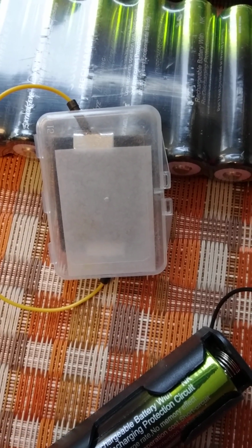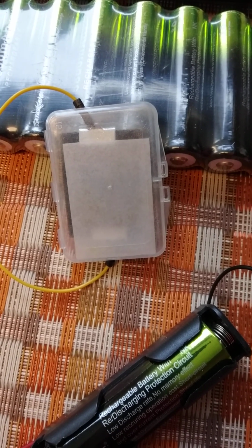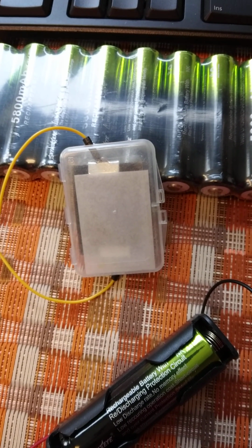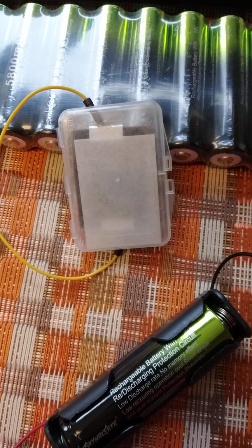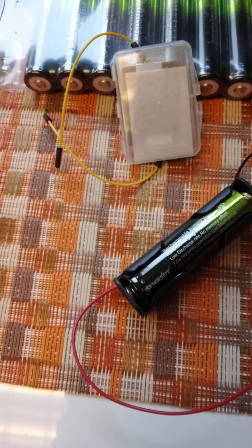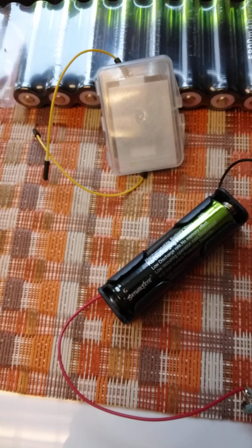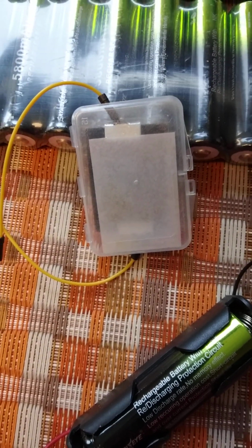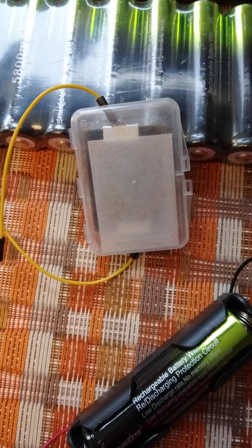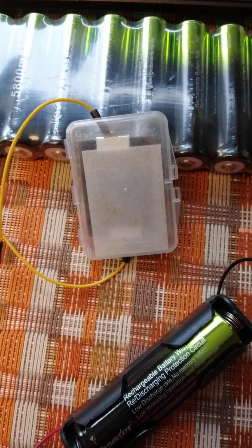It works very well, a section where after we applied the electrolyte solution, we put the paper in and pressed it to get it into the graphite. That paper was 0.1118 grams, so not much mass added there. And after the run, the mass was 7.280 grams. Before, 7.273. So we picked up about 7 milligrams, and that could be something in the plastic, could be that a subtle change occurred. We did use two different balances, but that shouldn't matter. They're calibrated. But just a small but measurable difference before and after in terms of mass.